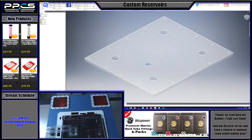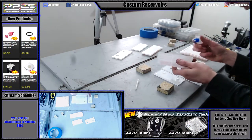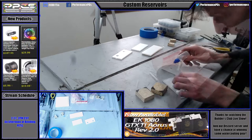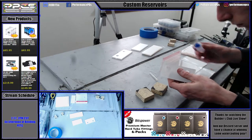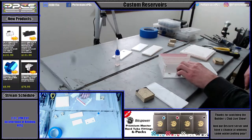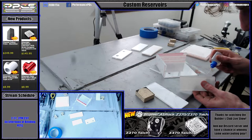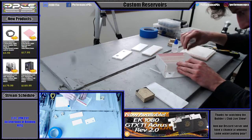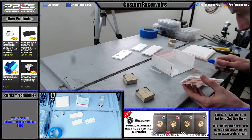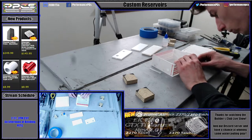Now let's jump to the more fun part of actually assembling this thing. I've laid out all the bottom pieces for the reservoir and started gluing on the sides. To do this I use low VOC acrylic cement — linked in the description below. It takes about five minutes to dry; hold it for a few minutes then let it sit. It actually takes a good half hour to an hour to set this up, let it dry, and put each piece in. I'm using square blocks to make sure all the sides stay square. Overall, just be patient, take your time, hold the pieces steady, and it should go together pretty well.